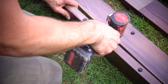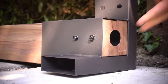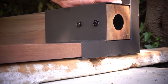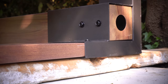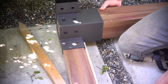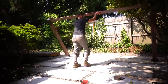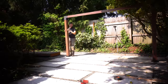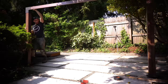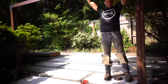Once all those pairs are fully assembled it's time to get this thing stood up. I lay down two of our vertical posts right on our concrete patio and insert our very first cross beam connection, securing it down with two screws before moving to the opposite side. Keep in mind that this is a faux print on aluminum and it can be scratched, so I place some 2x4s on the concrete to avoid any scratches. You can assemble these sections by yourself and maneuver it into position by shimmying one side and then the other until it's in the exact position you want.